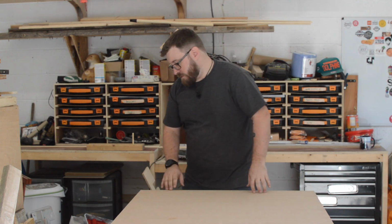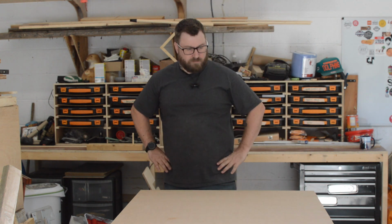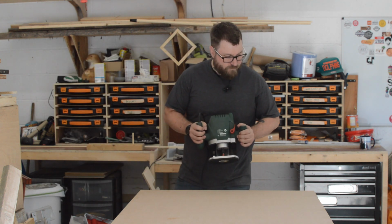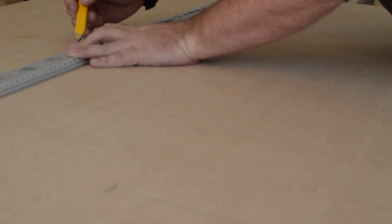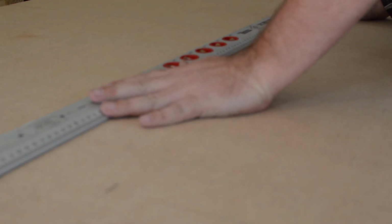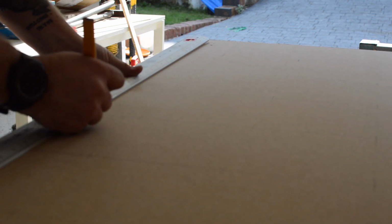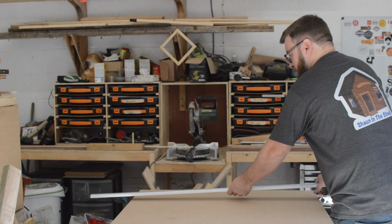The basic design of the donut wall is a sheet of MDF with a number of dowels drilled into it to allow the donuts to hang on. The MDF sheet I'm using for this project is 4 foot high and 3 foot wide. It's 9mm thick. I tried a thicker piece, but it was a little bit too heavy for the project. I intend to space the dowels 6 inches apart across the board. This allows me to hang 36 donuts times 2, leaving a space at the top of the board for the graphics to be applied later on.